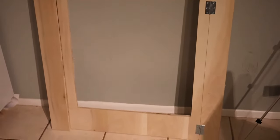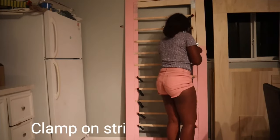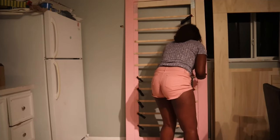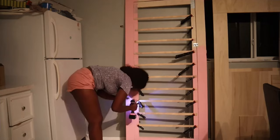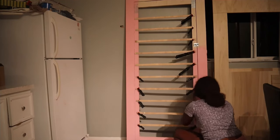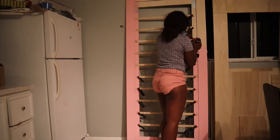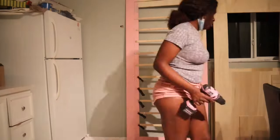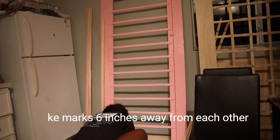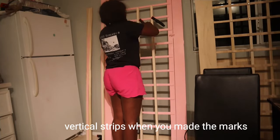This is what the door looks like so far. Now I'm going to install a window bolt to keep the door locked when not in use. You can see I'm using those horizontal strips I cut out earlier. I'm using clamps from Walmart to attach them six inches apart from each other, then going in with my power drill to make holes and screw them into place using half-inch screws. I'm using a yardstick to make marks six inches apart so I can start positioning the vertical strips.